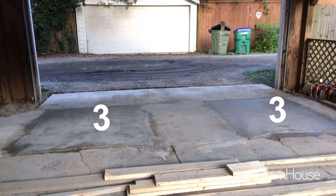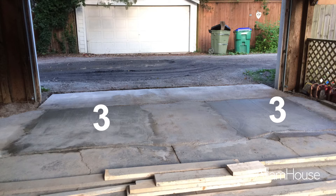I built a wooden frame and had to till down and dig out rocks from underneath so I could have a decent slab at the right height. I dumped in sand and set in some rebar, then graded it toward the alley — just a very minimal grade — so when rain comes down, it pushes water back out toward the alley and off to the sides.